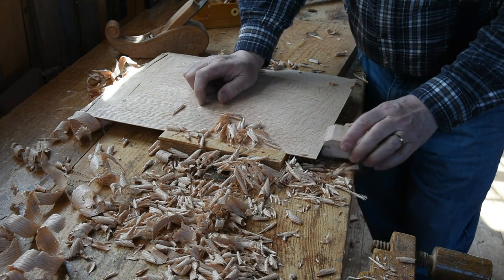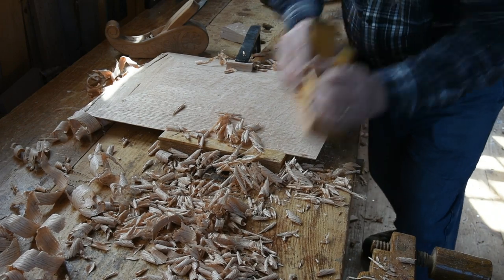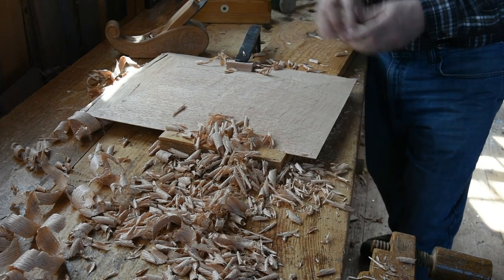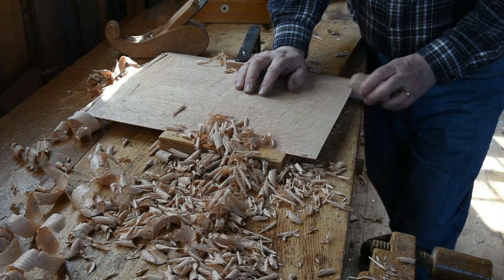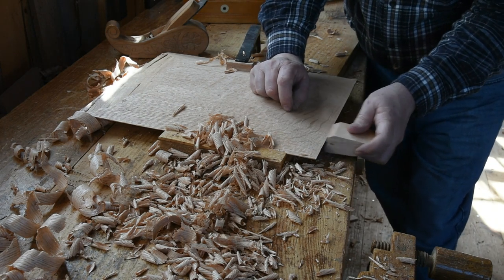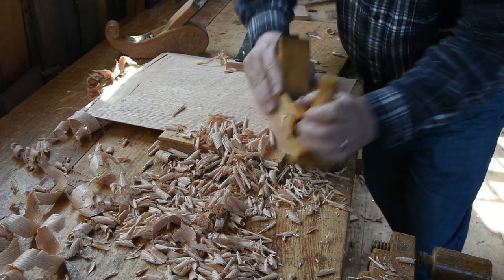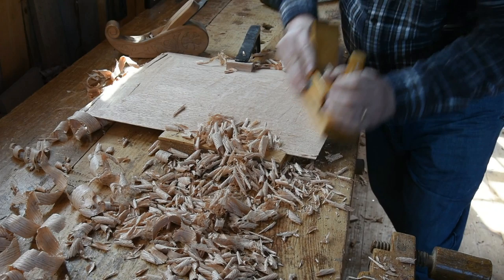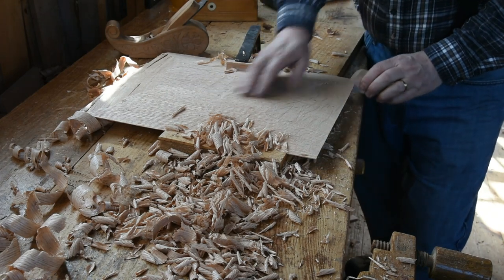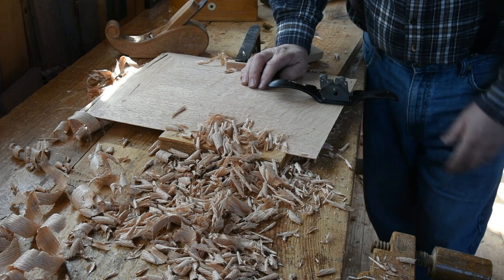See, it's still thick. It's really this area behind the edge that I'm after — not right at the edge, but that area right in there. I'll show you what a spokeshave can do for the same place — you can be a little more accurate with that. I'd still skew it a lot.